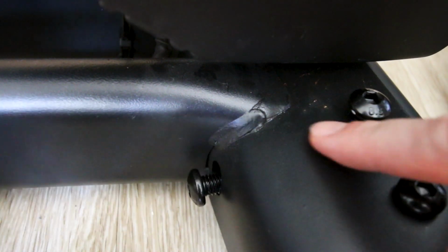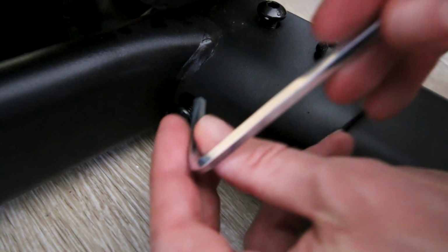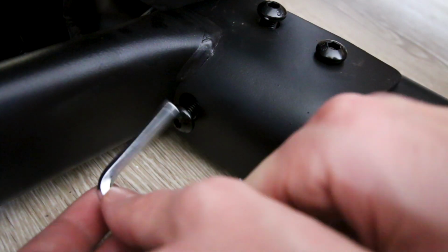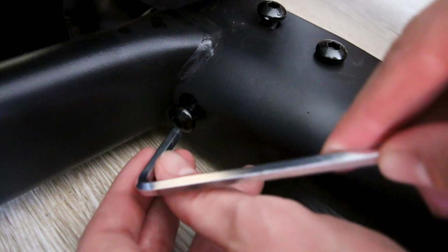It literally looks like the bolt is sideways right now, and it's lining up when it looks sideways. It might be kind of hard to see, but if you're having difficulty, like it's really tight when you're trying to tighten it up, it's probably because the threading isn't aligned. So don't cross thread it and strip the threading out. Just so you can see how easy it is for me to turn this right now, it's turning this easy. If you're pushing with all your might, the threading is not aligned.